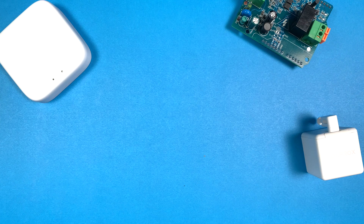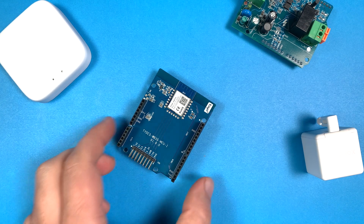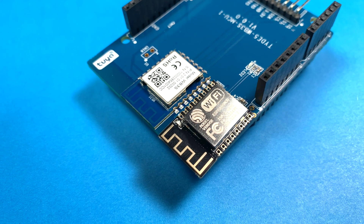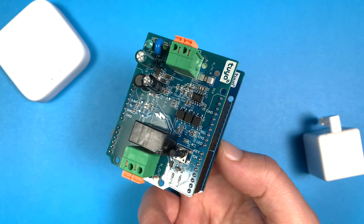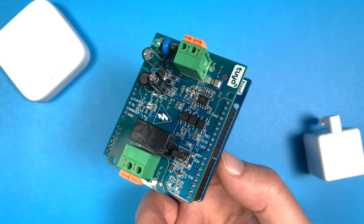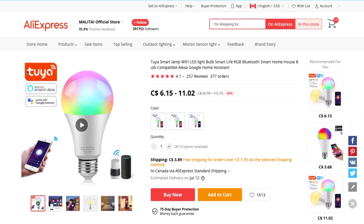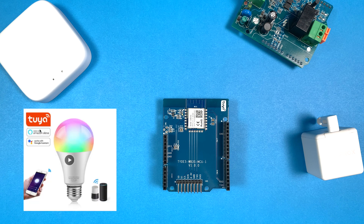These function boards have all kinds of sensors and actuators, and any combination of these boards can be used to achieve a specific product. For example, here is one of their microcontroller boards — it uses the WB3S board. If you are familiar with the ESP12 board, you might find the look of this chip very similar. They are almost pin-to-pin compatible and serve the same purpose: an MCU with Wi-Fi capabilities. They can be stacked or sandwiched with a function board like a reed switch or an RGB LED, very similar to the Wemos D1 Mini Shields. If you've purchased a newer Tuya-compatible device like a Wi-Fi switch and looked inside, you most likely found their WB3S MCU paired with a relay — and this was probably the prototype made from the sandwich kit used for testing before mass production.